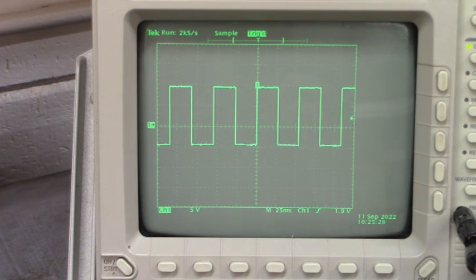Sometimes when an IGBT fails, the failure shoots back up through the gate and damages the gate driving circuitry. But in our case, we lucked out. This is a good IGBT gate firing board.